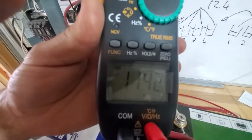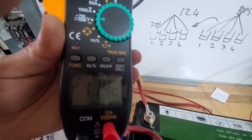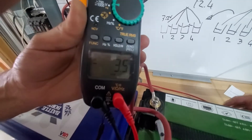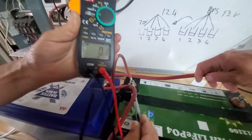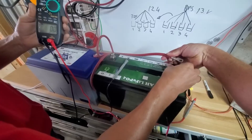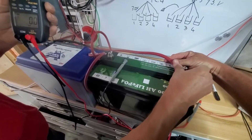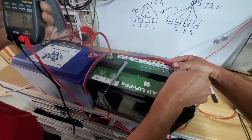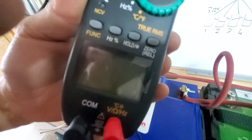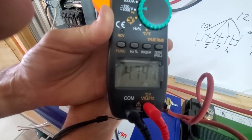This one I've discharged to 11.42 volts. In all fairness, that should be able to turn on a 12 volt inverter — that's how we think. So what I ask people to do is: take your positive terminal on the battery and connect it. Always measure in-circuit, because BMS's and batteries lie to you. When they're doing no work, they'll show you full voltage output. So let's measure again on the output — now all of a sudden it's 4.72 volts.